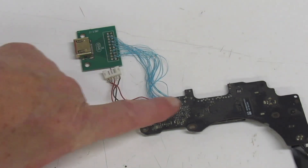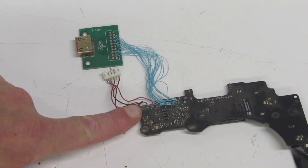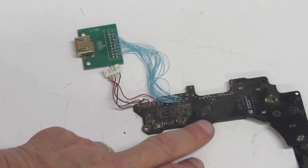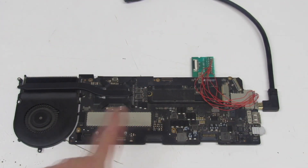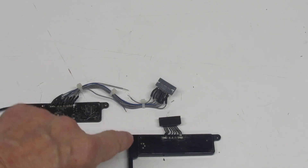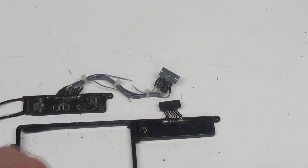On the I/O board, I extended the HDMI connector so it's accessible out the back of the PowerBook. I also removed the USB connector because of the profile — both connectors wouldn't fit otherwise. I used a ribbon connector instead of hacking a cable because of the length it would add to the logic board; I also wanted to keep the fan. Here's the modified battery board, which I extended because the original size wouldn't fit inside the PowerBook.